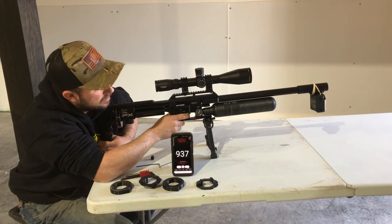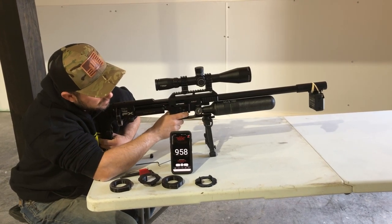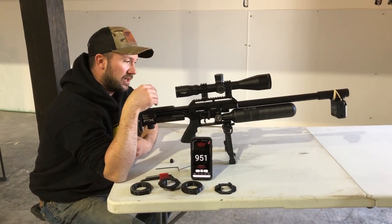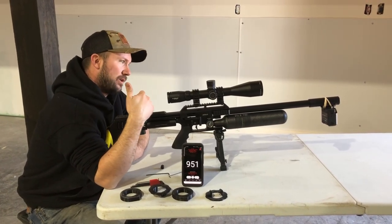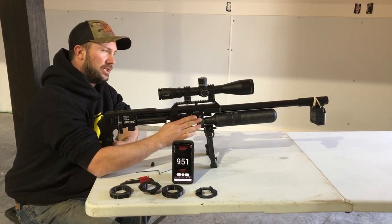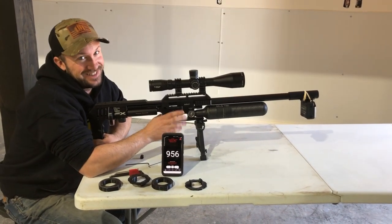900, 37. 900, 58. 900, 58. 900, 51. The thing to remember when you're tuning guns: you make changes, it's going to take a little time for those changes to settle in. You don't want to rush into changing stuff back and forth. You do need to put the gun through a bunch of cycles to see where it's going to settle in. 900, 56 — and I'd say we're going to settle in nicely now.